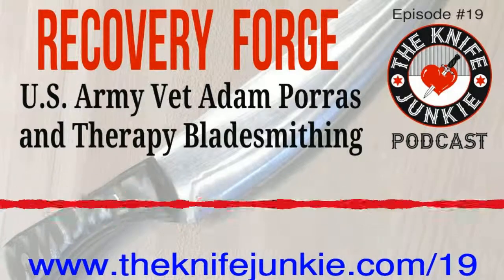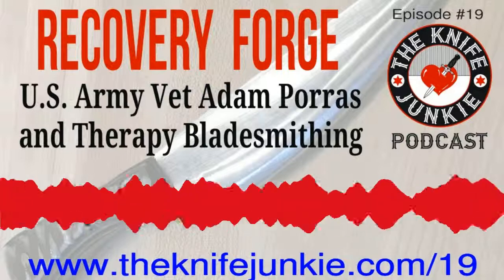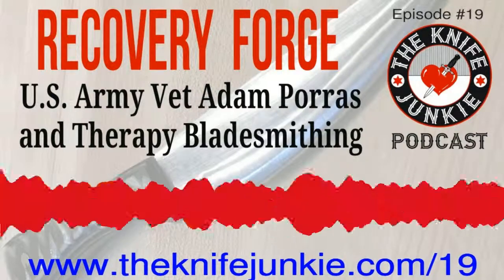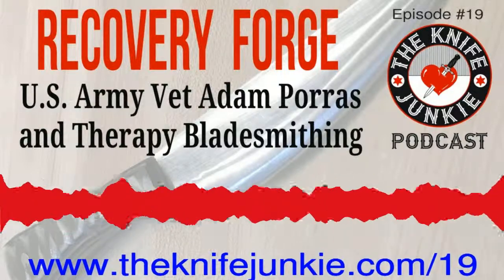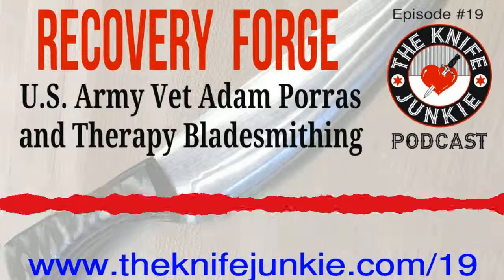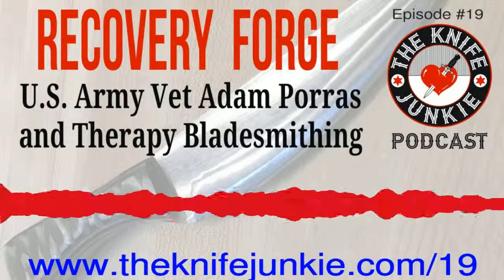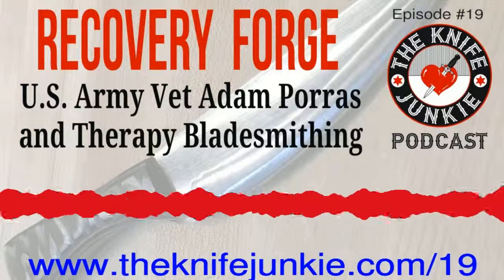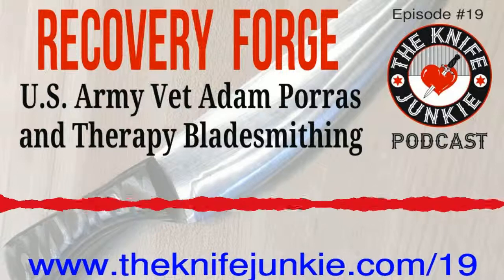Depending on how I'm feeling, I think at the end I made a long blade — almost a small Japanese katana style knife. Instead of a hidden tang, which requires a lot more work, I went with a full tang — that's what you have, with two pieces of wood on either side. Arguably the strongest construction there is, because it's a bar of steel with a handle on it, as opposed to a blade with a tapering tang that notches into a handle.